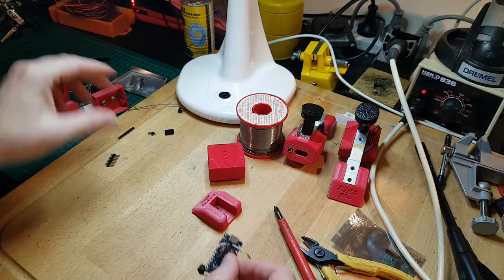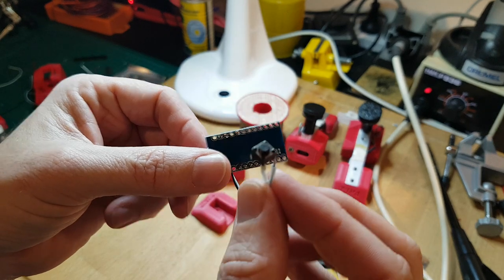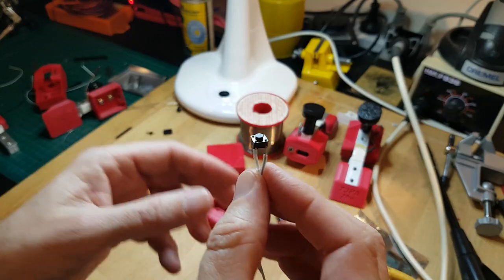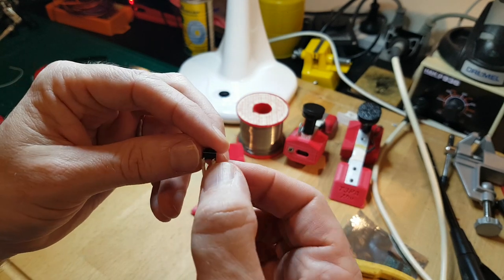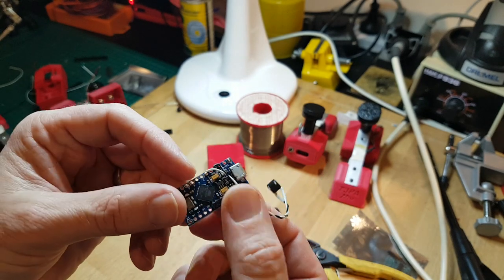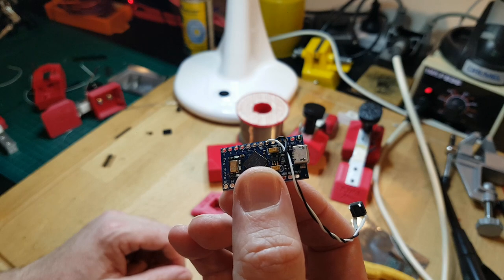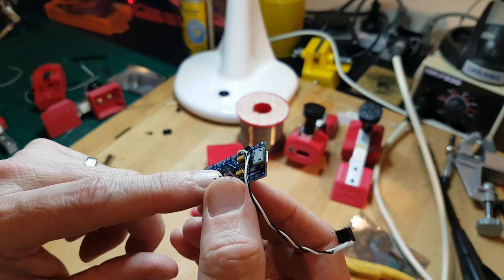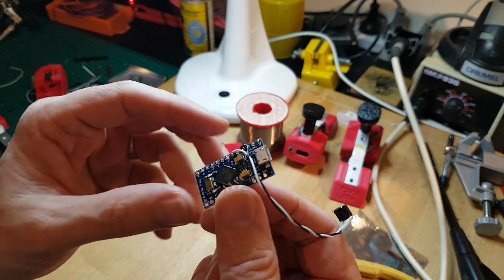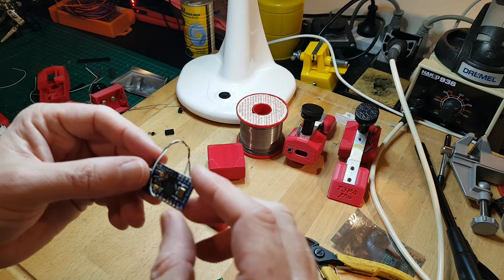That's ready to go. On the circuit board, I have the tactile switch, very, very small. Just a little bit of heat shrink on there. I'll either hot glue or super glue that in place. Currently, I think I've just got that sitting on pin 2, and it's nothing more than a button. You can actually send the same commands as this button via serial, which is probably going to be a better thing for the long term. But anyway, I'll get into code in another video.